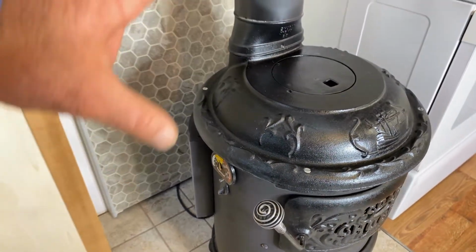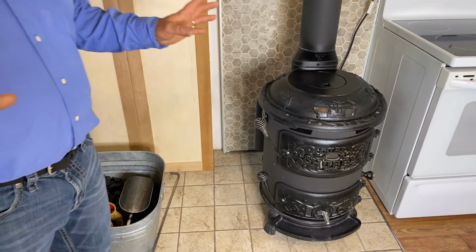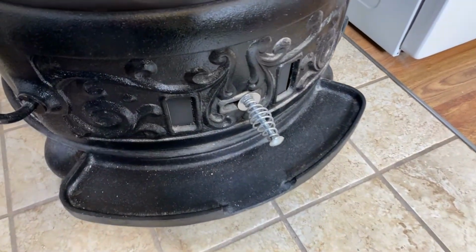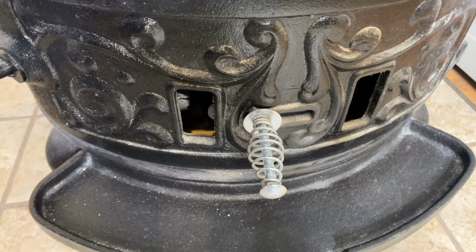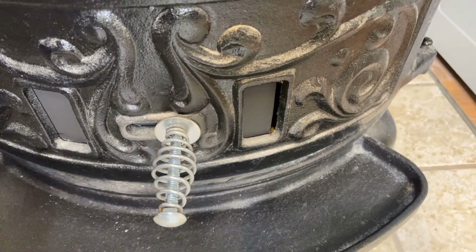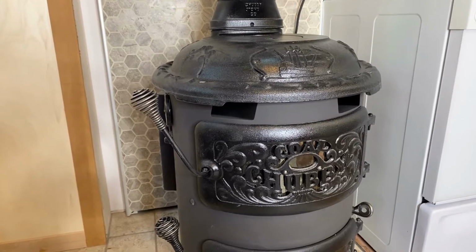But this stove is now in a steady state of combustion, and it can continue to give off this amount of heat for about 12 hours without doing anything to it. And the steady state we've reached right now is a function of two things. First of all, this is really the default position of the air intake. If you remember, that's fully open. We don't actually run it that way. We only have it fully open when we're servicing the stove. This is more of a typical opening right here, maybe a little bit of an opening. The openings aren't balanced on this particular stove. It's a little bit more on one than the other, but let's say for a moment I wanted to give this some more heat. The room isn't warm enough.